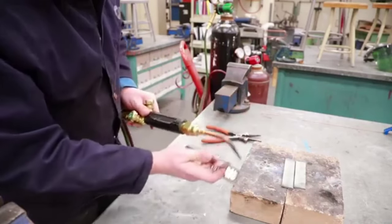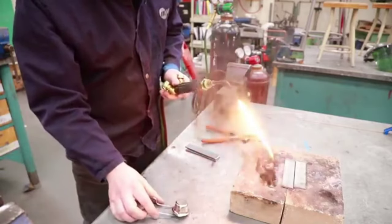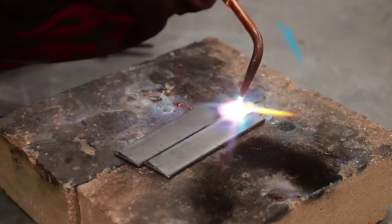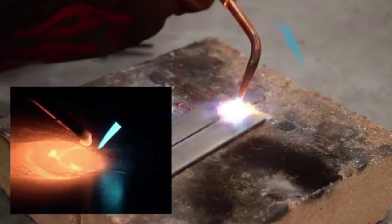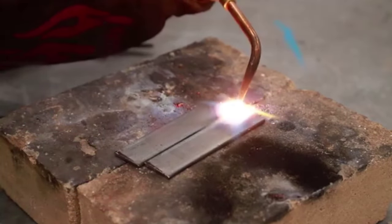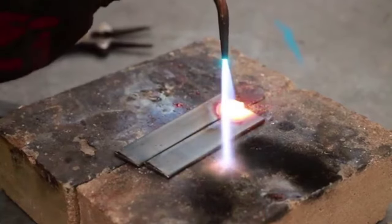Take your striker, hold it on a slight angle, side here, and you get a nice sooty flame. Get shiny on both sides and then those two shiny parts will join together into one puddle. Back and forth, let them join — there we go. There we have now a little puddle. I'm going to do the same thing to the other side.